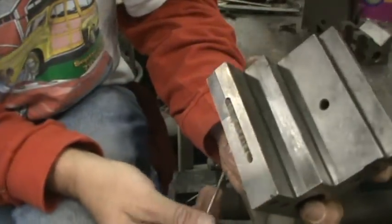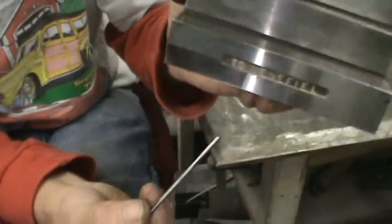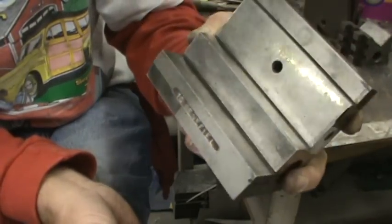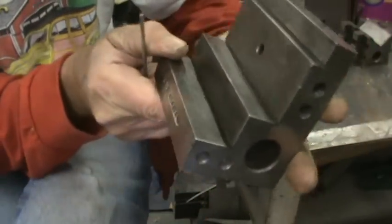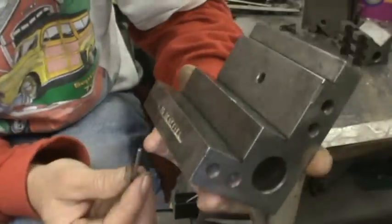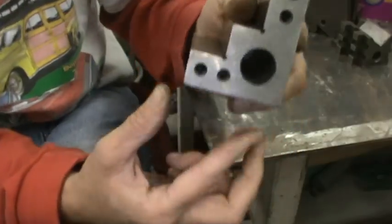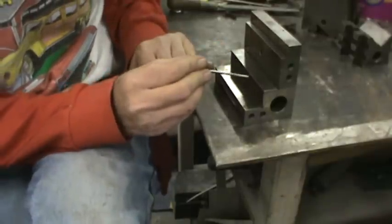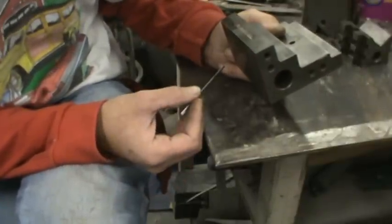This was made in about 1961 by my father. We never bought any tools — you made your own tools. This is made out of air-hardening steel, I believe it's A2. It's got his name stamped in it right there. He made three or four of these this size, and three or four that were twice as big. This angle block is balls-on — I mean it is perfectly square, perfectly parallel in every aspect, every surface within a tenth of a thousandth. That is very difficult to do.